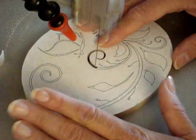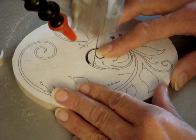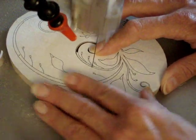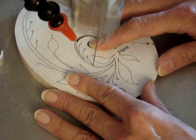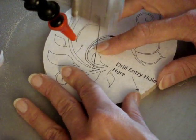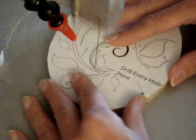Now this time I'm going to push to the right because I'm starting on the left wall. Just going to lean that blade, and once I'm in, you need to be patient when you're doing long straight lines like this, because if you push too hard you're going to break your blade. You just need to relax, put on some good music. Meet up with the other line.